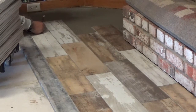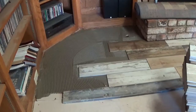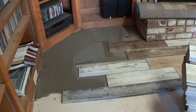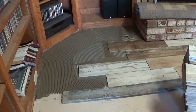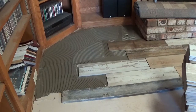I want to get a close-up here for you and show you how it looks. You can see the little finger combs — the way he takes the trowel and runs it around. That's the part that apparently makes it really easy to set the tile in, so it really grabs. And he's going to have to make the cuts all the way around that corner, which is a pretty hard turn to make.